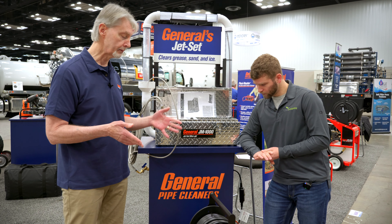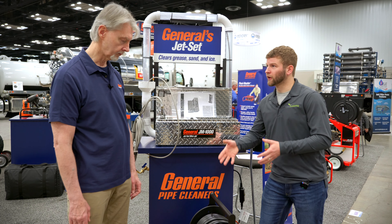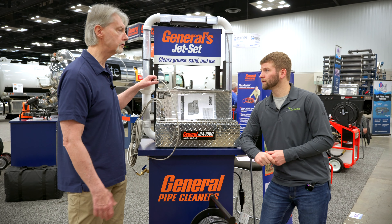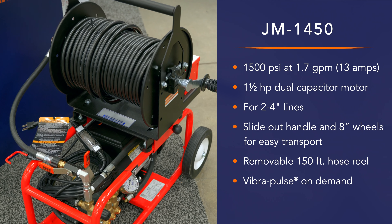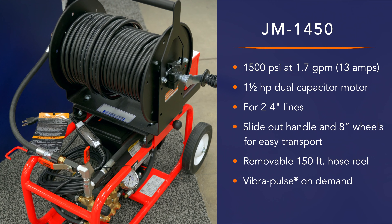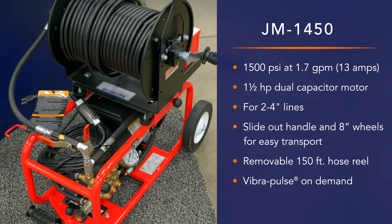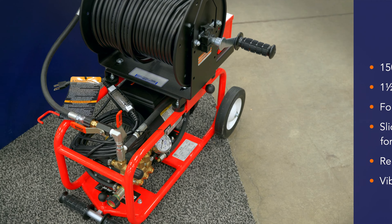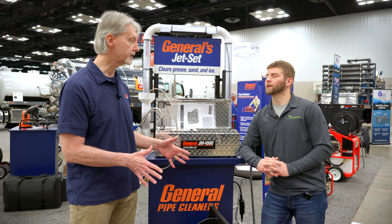They'll work in your house without blowing a circuit breaker. This is still a very small and compact unit, but it's a little bit bigger. This one is designed just for inch-and-a-quarter to two-inch pipes, maybe two-and-a-half — so sink drains and things like that. This other unit has another hose on it and will go up to four inch. So essentially this will do anything that's indoors — it can handle the smaller stuff, but if you need to take it up a level for four-inch pipes, this is the unit. It has an AR pump and a good motor, and this will last the rest of your career if you take care of it.